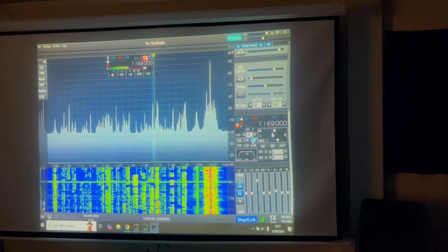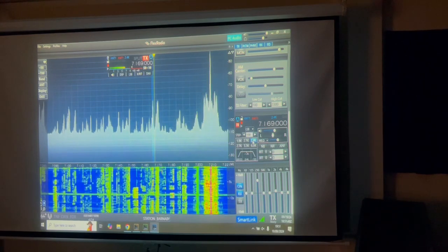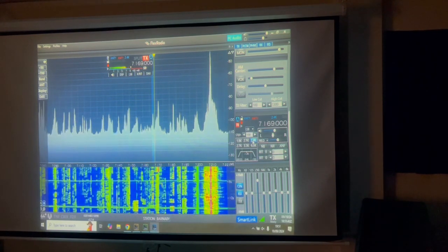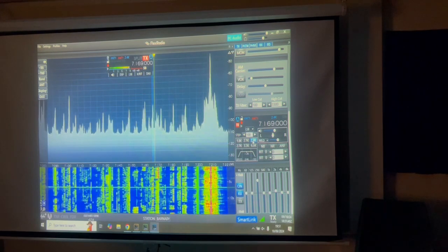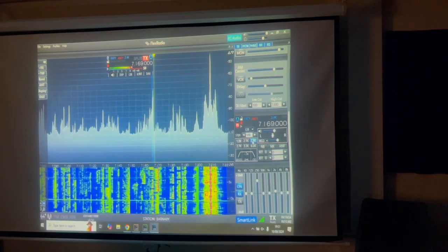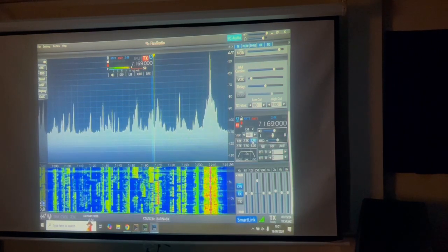So you spin the dial on that, and it spins up and down the VFO. You press it in, and then the buttons on the side become active, and you can change band, or you can change filter, or you press it twice, and it will change the tunable notch filter. So you have one button for doing lots of different things. So that's really nice.